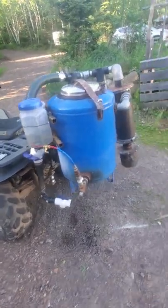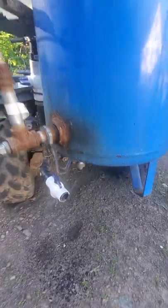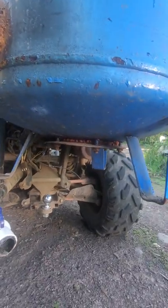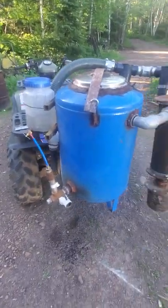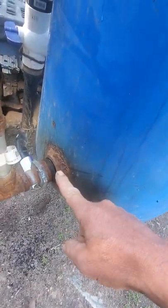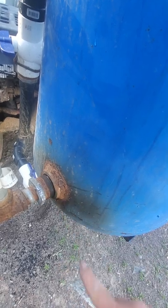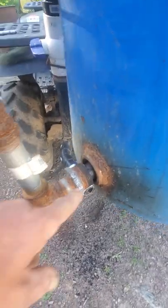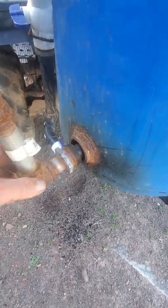It's actually pretty basic. What it is — I took a pressure tank for a well. I took the bottom out because it was plastic and I sealed it up with a metal plate. I used some high temp RTV. I welded in a coupling — I cut a coupling in half so that I could weld that into the pressure tank. That way I can put a reducer on there, an inch and a half, so it reduces down to three-quarter on this side and the other side.